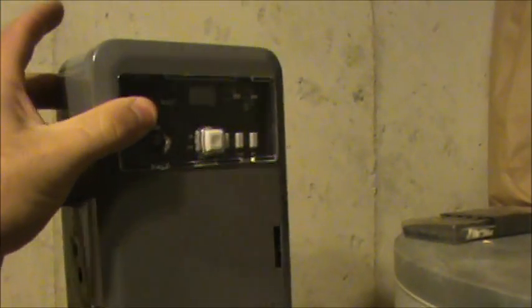Here's a look at the water heater. As you can see, we have our 10 gauge wire coming in — I pulled out the insulation, it's that orange wire — and it runs down here to the tank. We need to hook up our timer, and the first issue is there are no knockouts at the top of the box. This box is going to mount on the wall, so we're going to have to run the wire down the wall and into the bottom of the box, or put a knockout in the left side or the bottom right side.